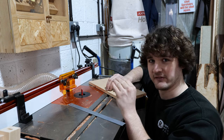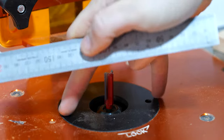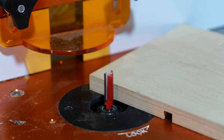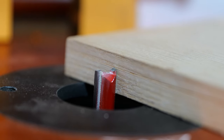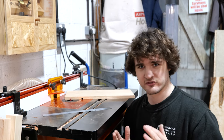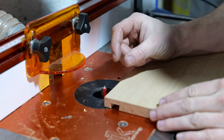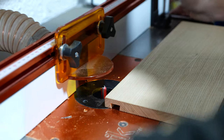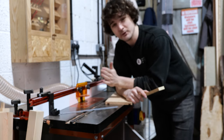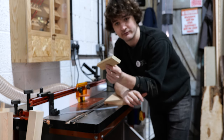When rebating the bottom corner of this component we've got two axes to get right: firstly, the height of the cutter to establish the 10 millimeter depth of cut scribed with the marking gauge; and secondly, the offset of the fence to set how far into the component the rebate goes — in this case 4 millimeters to fit the 4 millimeter panel. For height, I just put the piece of wood up against the cutter where I can see the marking gauge line and bring the cutter up to that. The height doesn't need to be bang on since we'll size the back panel to fit anyway, but the fence offset is critical because we're working to the fixed dimension of the 4 millimeter plywood.